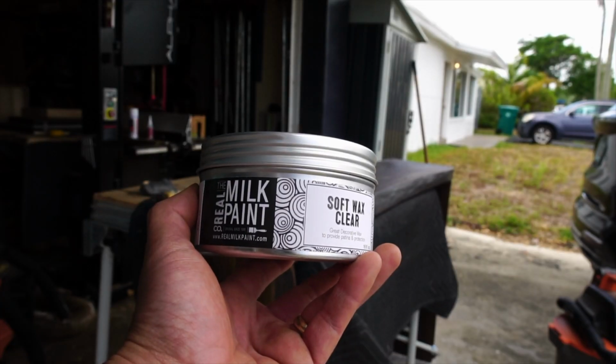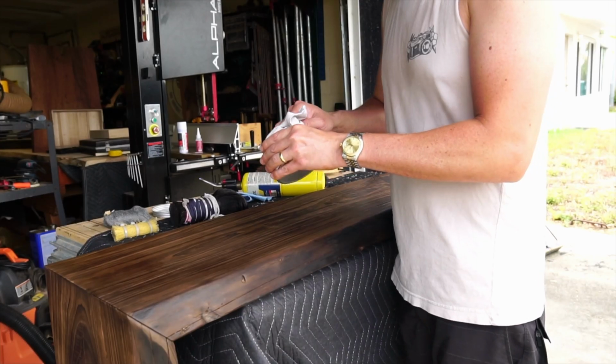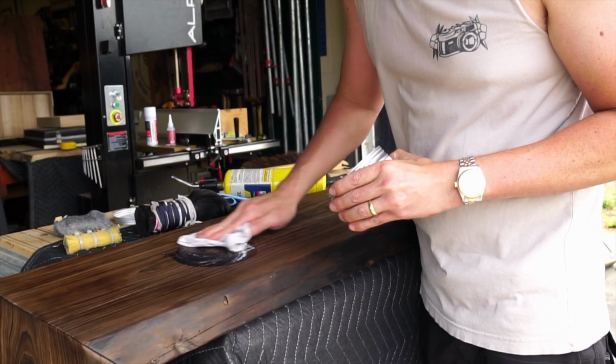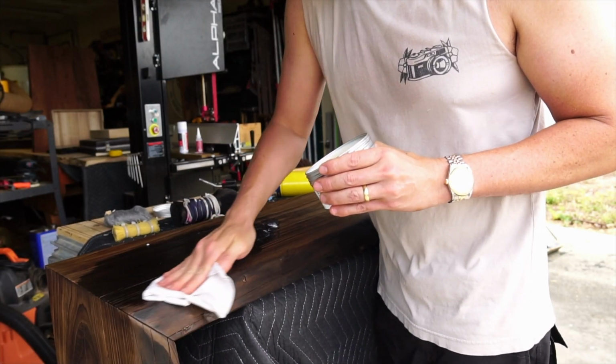As I said earlier, the finish is a simple wax, especially since I put so much effort into burnishing and creating a shiny surface with uzukuri and finishing with plane shavings. This stuff is great and foolproof to apply and maintain, just a simple wipe on and wipe off.